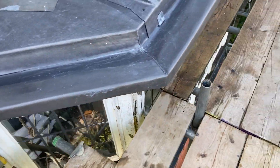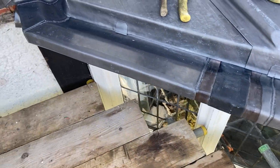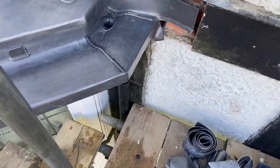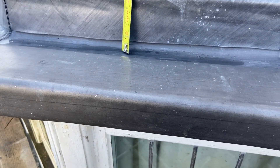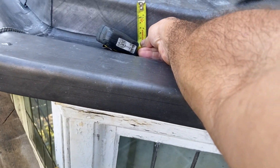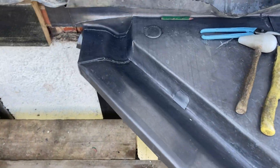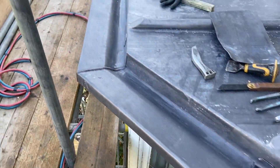Then we'll finish off this gutter, get that completely welded as well with the missing gussets. I'll just leave the flashing. Now, this gutter is existing, and to be honest with you, it could have done with some more outlets, but we couldn't change it because it is basically what it is. Unfortunately they have only got this small little outlet, and it is taking a lot of water. But because this roof has now been raised, luckily we do have 100mm — we're at about 95mm upstand and 85mm downstand — so it's just alright not to have a splash lap, because you only need 75mm on a vertical. We have got enough cover there, but it could have done with more outlets. So what we're going to do now is concentrate on getting these gussets welded up, and then we can do some flashing.